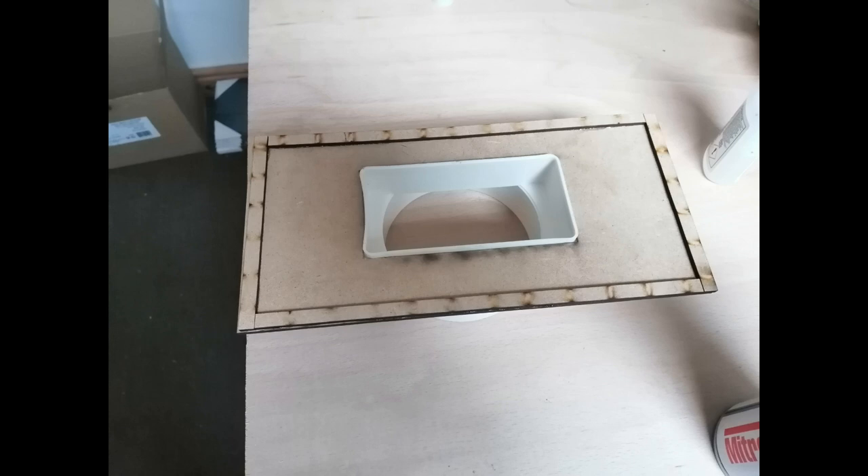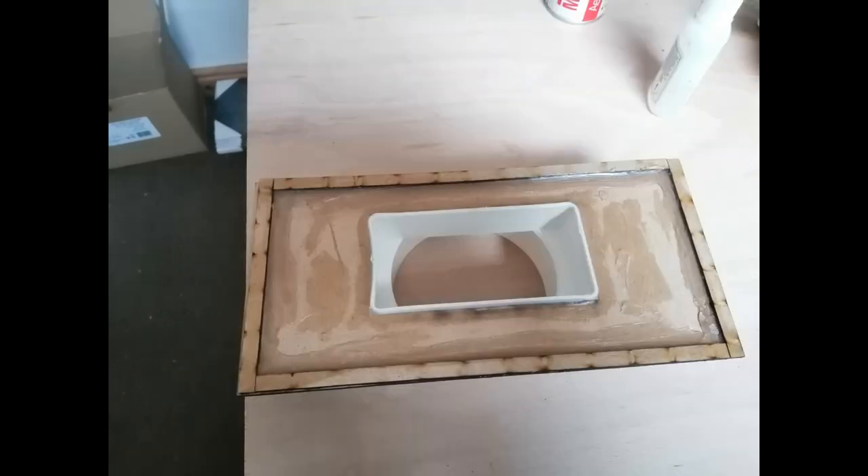What I did was make an extra couple of strips around the outside to make the adapter thicker, because it's a 6mm gap on mine and that fits fairly tightly. The reason I did it around the edge and didn't make it a full 6mm thick is to avoid the screws at the back — they stick out a fair bit. I then siliconed around that edge to make it airtight, and also added silicon around the inside of where the hose adapter comes into the piece of wood, and around the edge where I'd glued the bits down to make it thicker.